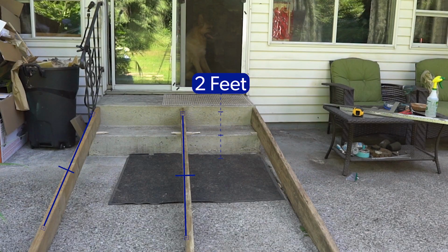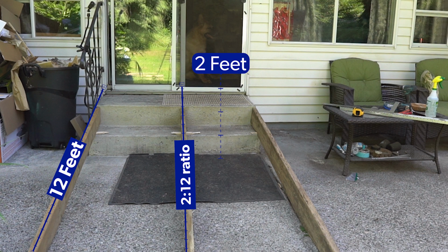All right, so now we need to figure out the slope. And the way we do that is in the description below. As I mentioned before, there are some guidelines, specifically 3 guidelines. One is a 1:12 ratio, one is a 2:12 ratio, and one is a 1:16 ratio. We're going to use the 2:12 ratio. Now what that means is for every 2 feet of rise, we're going to need 12 feet of length. Another scenario, if you have 4 feet of rise, you're going to need 24 feet of length.